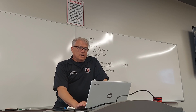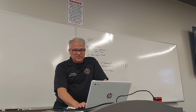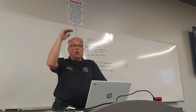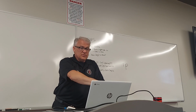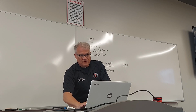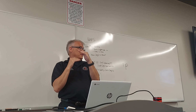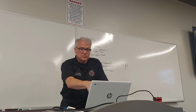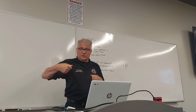Yep. All right. Wall post indicator valve, there's a window, as is the post indicator valve. There's a window, open shut or open closed are the words that are going to appear there. Just like the OS&Y, see that little wrench here? Okay, and that valve there, if you turn it, guess what? You're doing the same thing with the blocker plate, moving it up or moving it down. So that's the same thing. Post indicator valve is just a butterfly valve. It just opens 90 degrees.